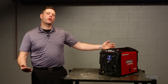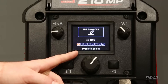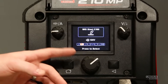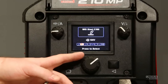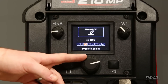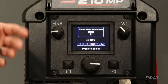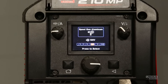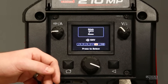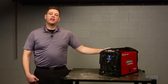The first process we're going to walk through is one of the more common uses of this machine — MIG welding with mixed gas. The first selection is MIG steel C25. There are a couple other options: MIG steel optimized for pure CO2; manual CV mode, which allows you to adjust the machine to whatever settings you want based on your electrode; flux core, for gas shielded or self shielded flux core wire; spool gun aluminum — if you're welding aluminum, we recommend the Magnum Pro 100 SG spool gun; stick welding; and TIG welding.